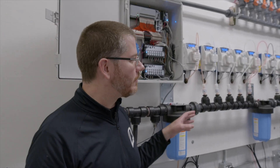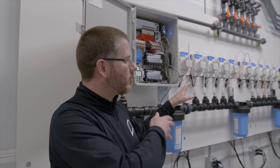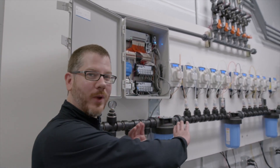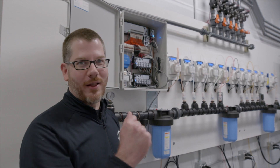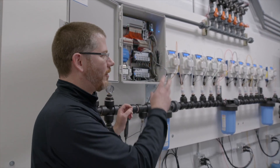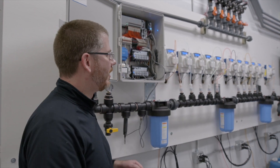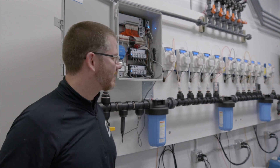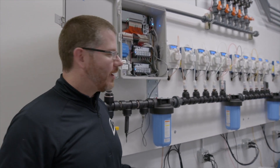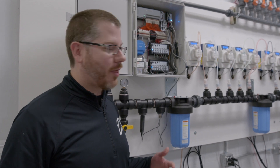The magic of the system is that once it's done feeding the week 3 flower for room 1, if they need to go right into week 2 flower, it can do that like that. The first solenoid will close, the second solenoid will open, the program will switch over to — week 4 flower recipe, as an example — and then start dosing that directly to those plants. So it all can happen quickly and is very dynamic, responding to changes in the recipes as you come up with them.